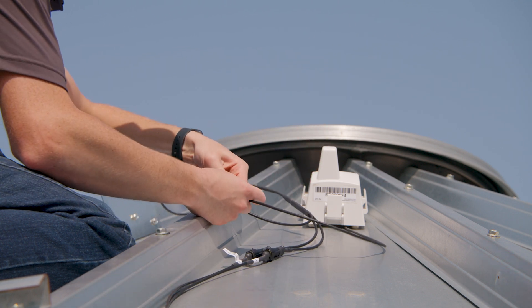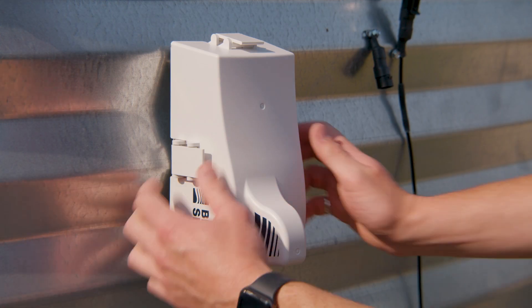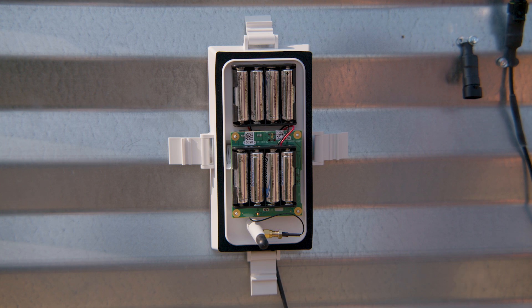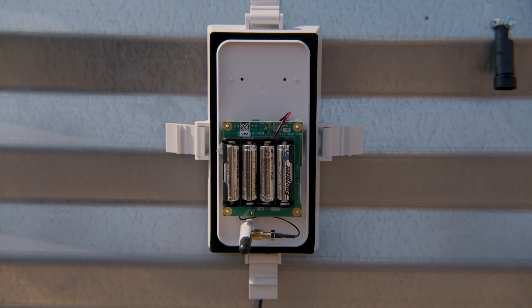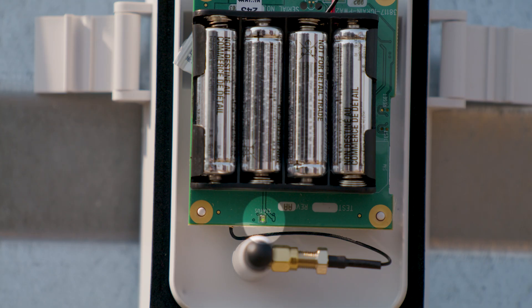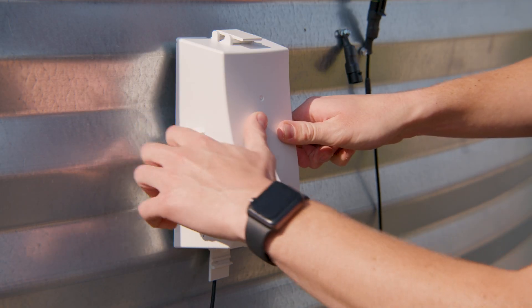Remember that Solo can read a maximum of four cables with a total of up to 48 sensors. Next, open the Solo unit and remove the tabs from the battery compartment. Note that some Solo units have two battery clips inside and two tabs that need to be removed. Once the battery tabs are removed, Solo will connect to the Binsense app and website right away to let you know everything is connected and working properly. Keep an eye on the status LED and verify it briefly turns solid green to confirm the Solo unit is connected to a cell tower and the Binsense servers. Once the status LED turns off, put the cover back on the Solo unit and make sure all four latch clips are securely closed.